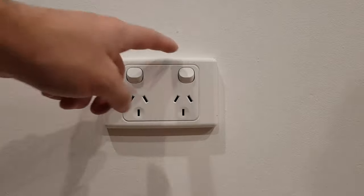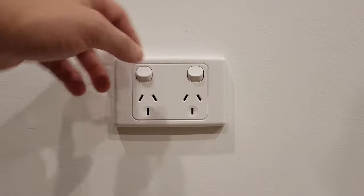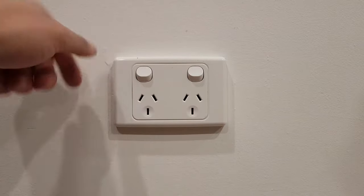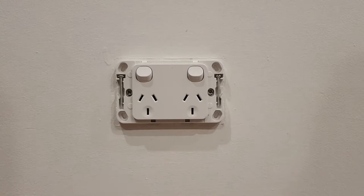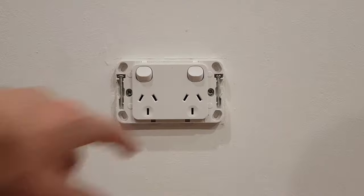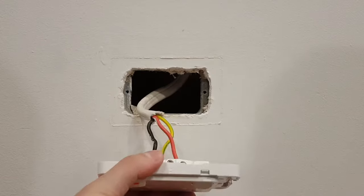To remove the power point you want to remove this cover. Sometimes there's paint around the cover, so you might just want to use a sharp blade to remove the paint around it so you don't peel any off your wall. Once the cover is removed, just determine what screws you have screwing the power point onto the wall. In this case I've got a Phillips head screw — you can also use a flat head — and just unscrew your power point. Once you've unscrewed it, just move it forward to expose your wires.